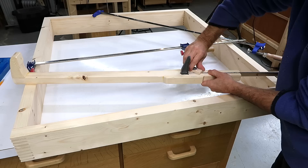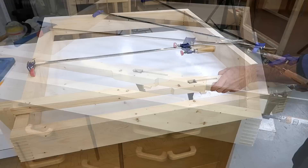I could hook two clamps together, but that gets too fiddly. So maybe I could just extend the clamp, since I only need the screw mechanism on one side. I came up with this clamp extender — the regular clamp just fits into here, close that in to lock it, and then I can use it as though it were a really long clamp. I've already used this gluing together this frame here.